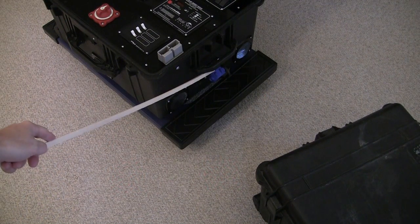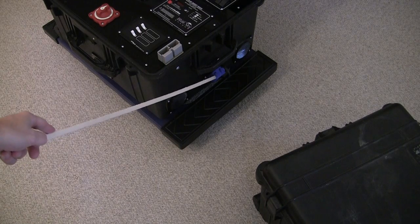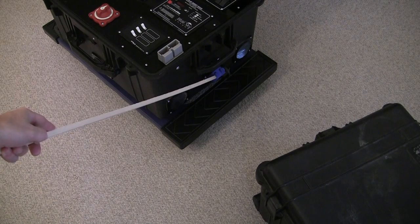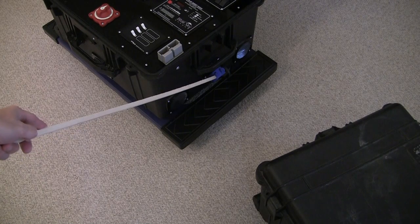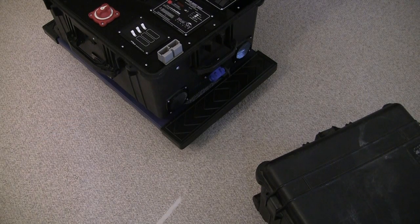On the side of the box is my power input plug from my solar panels. I fabricated my own 50-foot cord, but if I had to do this again I probably would have just used a 30-amp generator cable — that would have been much easier than creating my own extension cable and hunting down these plugs. I also have two vents on that side, and this is where power initially comes in.